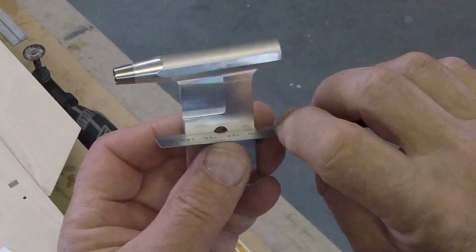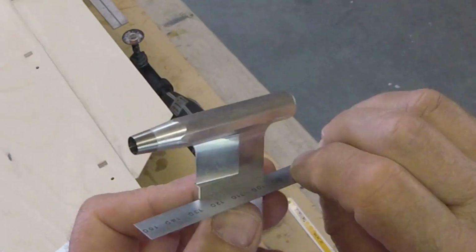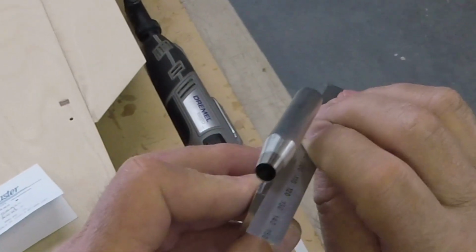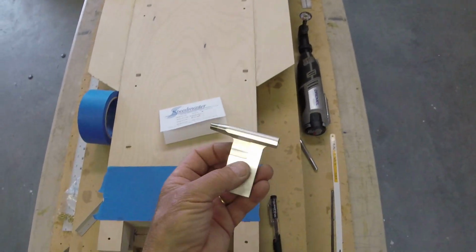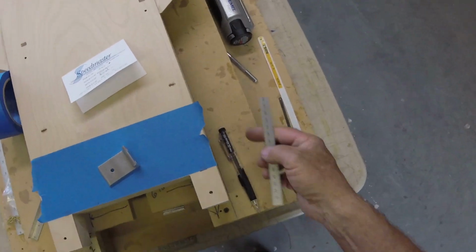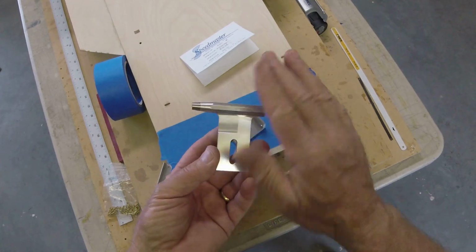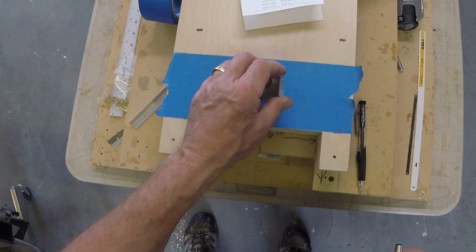that is going to, imagine this is our rear floor here. We're going to sink this strut in well beyond that. And we're going to introduce a heck of a lot of water into the boat through that. So we're going to fill this. We'll do that later. Just warming you up to the idea now so you don't start yelling later when we actually have to do it. JB Weld, that's all. Get some JB Weld. We're going to fill this with JB Weld. It works out just fine. And then you're going to sand it and it'll look like it was made that way, but not really.